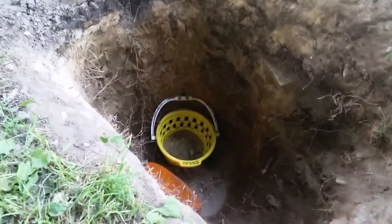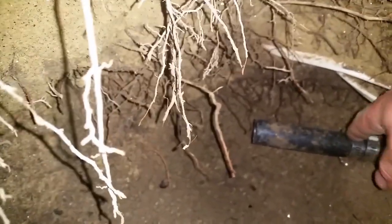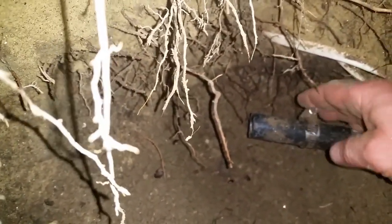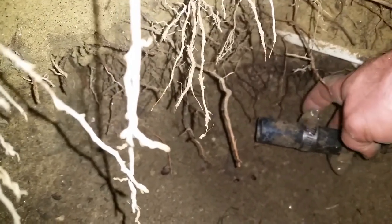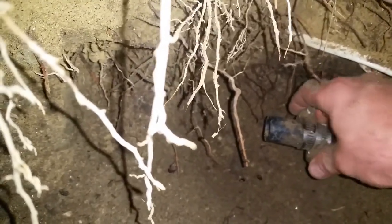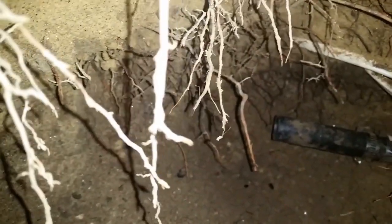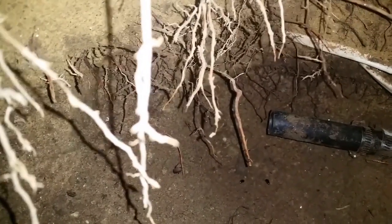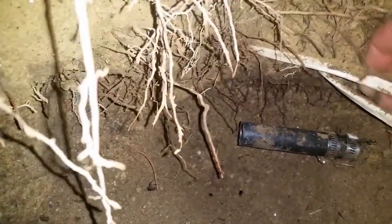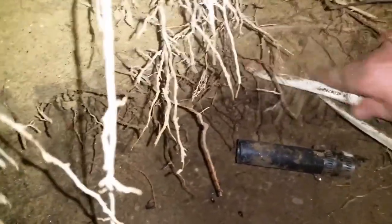Down at the bottom of the hole here's the pipe going to the ground with two hose clamps on the fitting. I put them in alternating orientations — one tight on this side, one tight on the other side. I'm also going to turn the valve on briefly to flush any dirt that got in the end of the pipe. One thing to point out: when this was installed there's also some electrical line run with it.